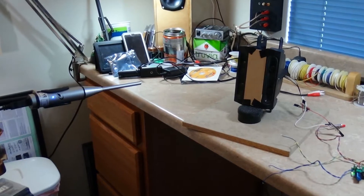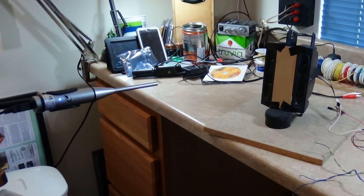First, let's put it on the DATS — the Dayton Audio Test System — and we'll double-check the tuning and the specs for the ohms on the two voice coils. Then we'll run some sweeps on it with the Dayton Audio OmniMic to see how well this oddball driver performs.